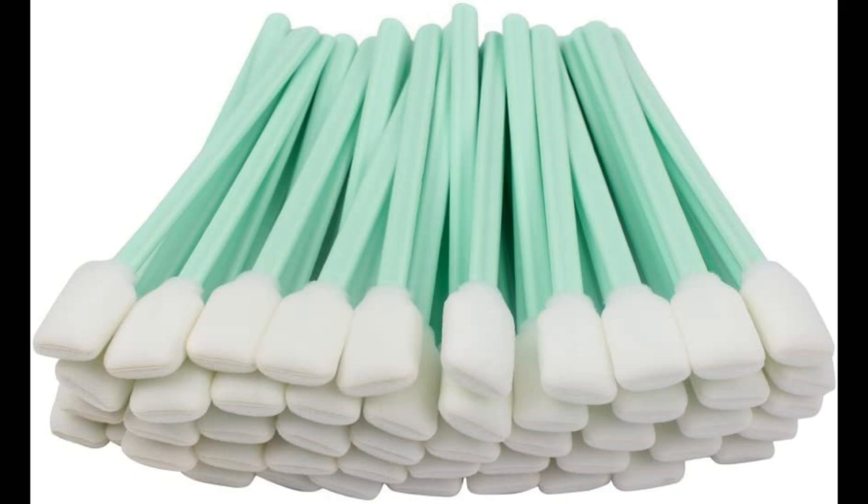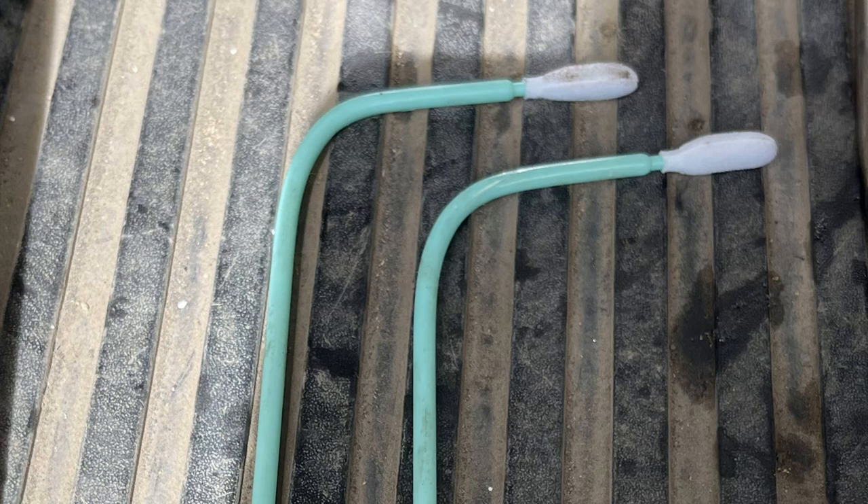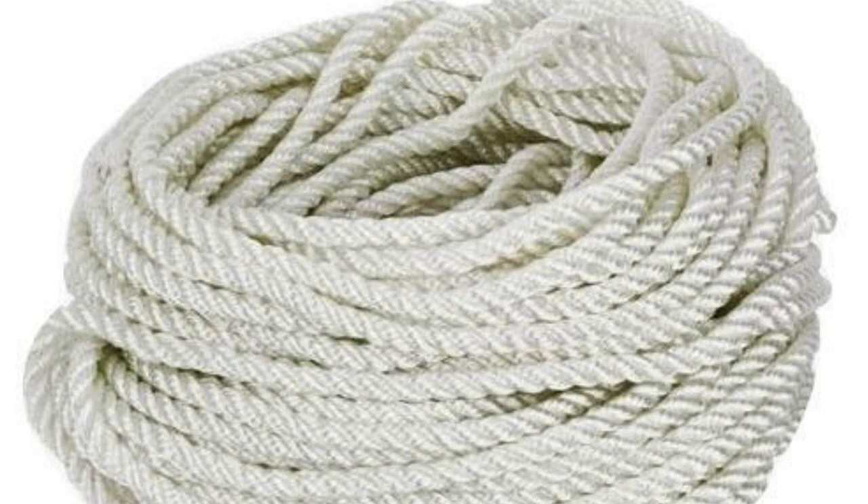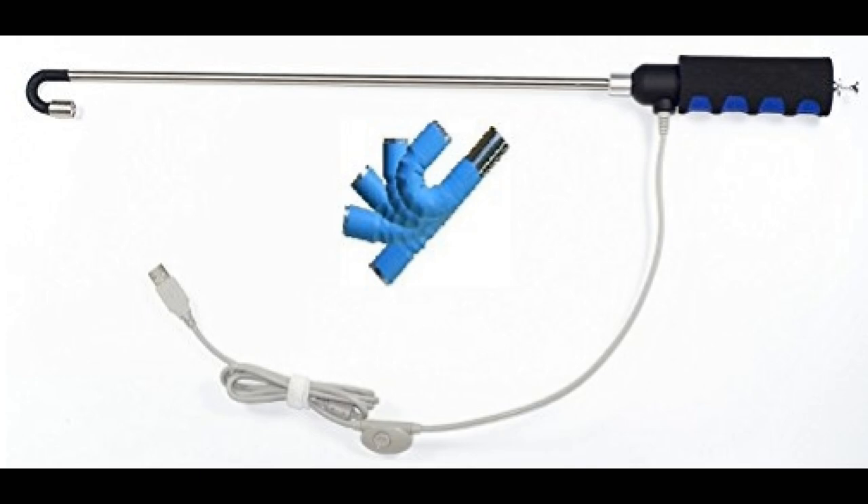Also from Amazon, I purchased a pack of 100 of these 6-inch long plastic foam tip applicators used mostly for gun cleaning, and I used a heat gun to put a bend in their handles about an inch and a half from the tip. Also needed: a battery-powered variable speed cordless drill like this Makita, some three-eighths inch ID tubing that will slip over the valve stem, a valve spring compressor, 25 feet of quarter inch nylon rope, and — perhaps most importantly — a high-quality bore scope like this Full HD Vividia VA400 with its articulating camera.